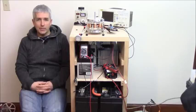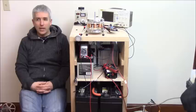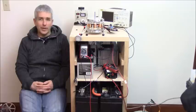So here you have this battery that's being used to run regular loads with this type of charging. You discharge all the way down to zero again, and now you try and put a regular charger on it, and it's not taking a charge. You may leave it on there all day and try and run a load off of it, and it doesn't do anything. That should tell you something.